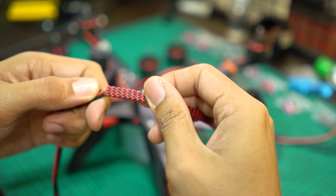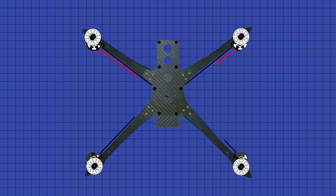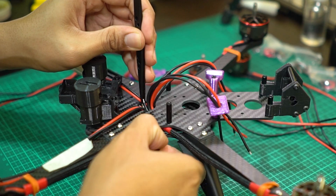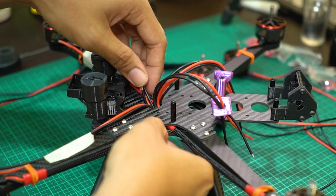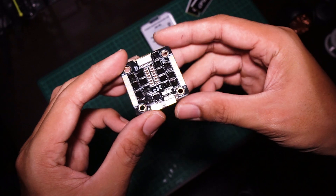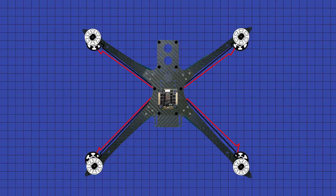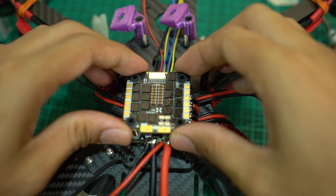I sleeved them up with braided sleeve for the motor wires. They would actually go down between the bottom and the middle plate and they would pop up through the center back hole to meet the ESCs. Now these are the Foxeer Reaper 65 Amp ESCs. For my build, I put the 4 bottom motors wired to the lower ESC, while the top 4 motors would be wired to the upper ESC.